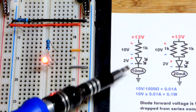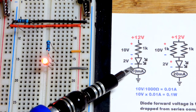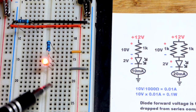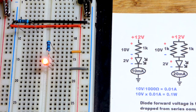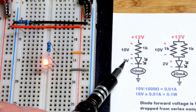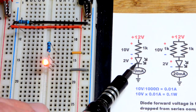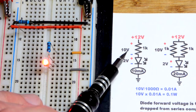In the last video we looked at the forward voltage of diodes and LEDs. The longer lead is the anode (more positive) and the shorter lead is the cathode (more negative) — that's the direction for easy conduction. When forward biased, a diode drops a certain forward voltage and doesn't limit current on its own, so we use a protective resistor in series to limit current.